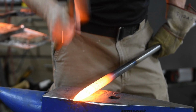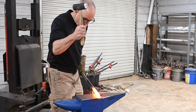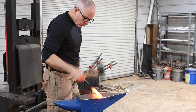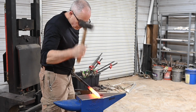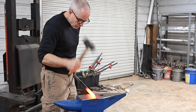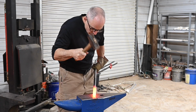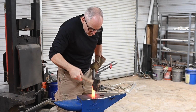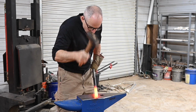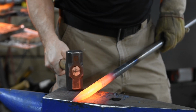Now, I'm going to be doing most of the forging today by hand just to show that it can be done. I'm using 1-inch or 25mm round bar because that'll leave plenty of material for a really king-size chef's knife. You can easily get a 2-inch wide knife out of this. But I will not lie, silver steel forges a little hard, plus this is a pretty sizable piece of stock, so you'll really have to go after it to get an integral out of this by hand.